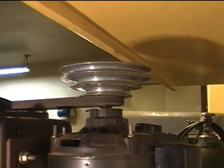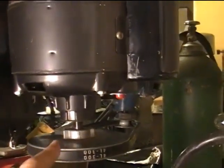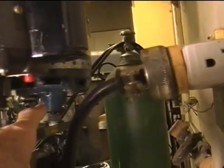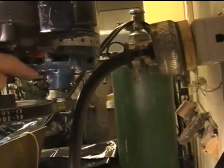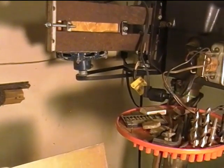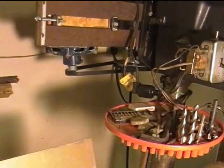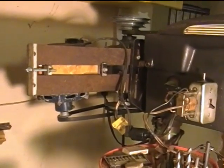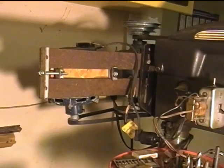You can see the main drive motor here. There's the four-speed pulley on top with its belt, and then here on the bottom I've added a six-inch pulley and in this case a 30-inch belt. Back there you can see a one-third horsepower sump pump motor with a one-and-a-half inch pulley on it. Here's the left side view of the modification. So with the one-and-a-half to six-inch pulley on the bottom and the belt set for the slow speed on the top, I end up at about 140 RPMs with this setup.